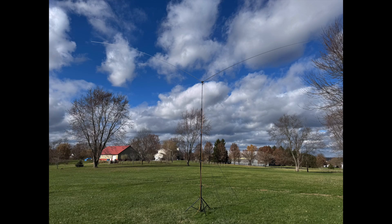So, how well does this antenna perform? The MC599 performed very well in my testing. I worked a number of stations from my backyard and POTA activations. On one of my activations, I was only running 5 watts QRP. I had a lot of success with it on 10 through 40. One thing to keep in mind is that this antenna is big. With the whips fully extended on 20 meters, it covers approximately 32 feet tip to tip. On 40 meters, it is a full-size dipole and covers approximately 65 feet, so you will need some room to install this beast.